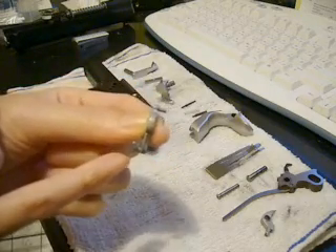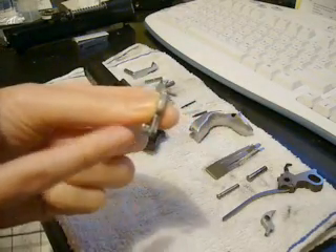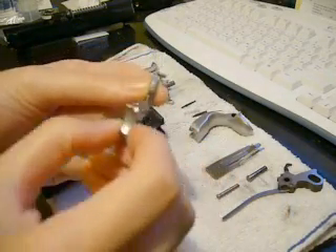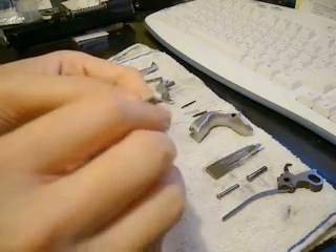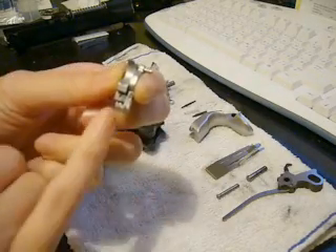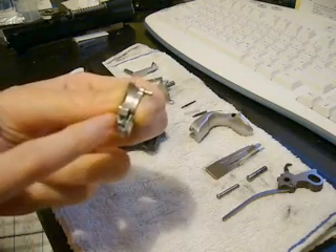This tab here — for a factory WA leaf spring, three leaves — it's not supposed to touch; no spring is supposed to push onto it. And the sear, inside the frame, will be right beside the ear. The middle leaf of the three leaf spring will push on the sear tab on the sear only.